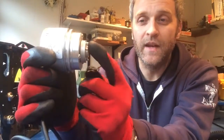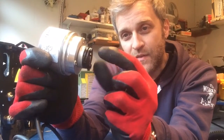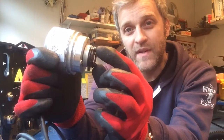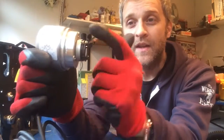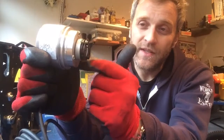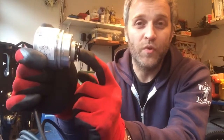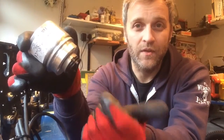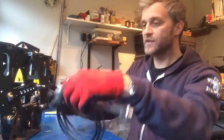On the end there's a little bellows coupling, which attaches to the axis. What that allows is misalignment of the two axes so you don't damage the encoder, but it still transfers rotation. There's also a modification - an aluminium ring with an oil seal inside it to add additional waterproofing to the encoder. The cases are IP67 or IP68, but the shaft was only IP65, so we added an oil seal as well since these are out in the open.